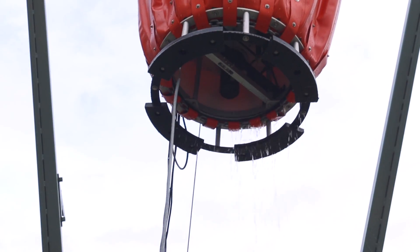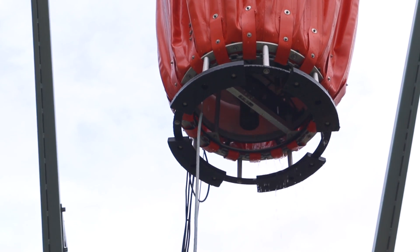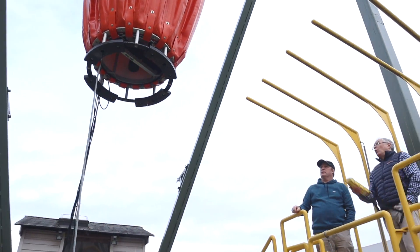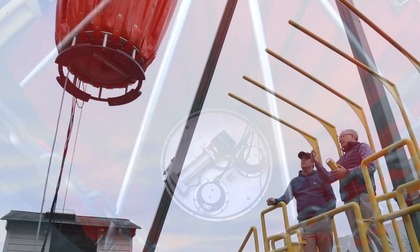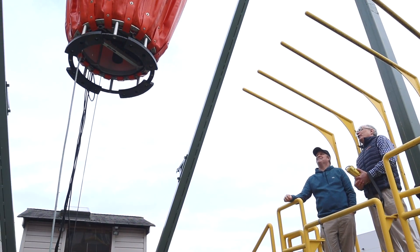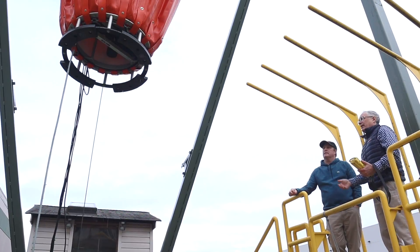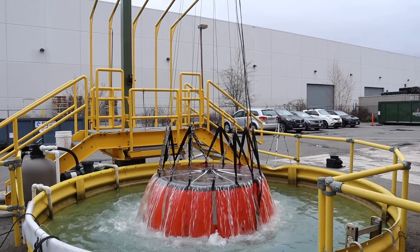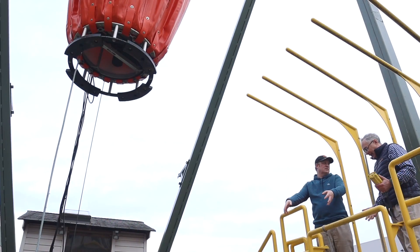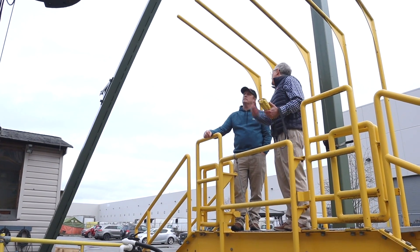This is the Bambi Max valve. What is the ring on the bottom of this bucket for? This bucket actually has a set of pumps in it. That ring is a standoff — otherwise people will just put it right onto the bottom and it'll suck itself in. It doesn't really work as well as people might assume, because people think they'll set it down on the bottom of a lake and use it to fill the pumps — but there's no way you're going to set this down on a lake; it's just going to sink into the sludge.